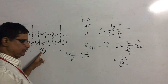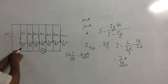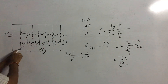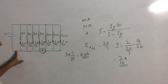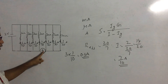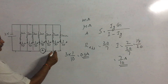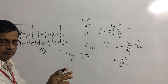The reading is 0.3 amperes. Now, if the ammeter had been placed at the main line, the reading would have been 7/10 = 0.7 amperes. As you move the ammeter from that end to the other end, the reading gradually decreases: 0.7, 0.6, 0.5, 0.4, 0.3, 0.2, and 0.1. So as you move the ammeter along the circuit, the reading gradually decreases.